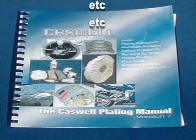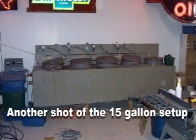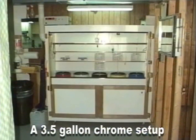Try plating nickel over nickel. When you buff this, you'll soon see that it's important to activate the old nickel in battery acid to make the new nickel stick. Until you've mastered these skills, it's fruitless to try plating anything else. Keep practicing until you are happy with your results.